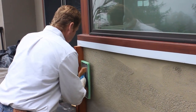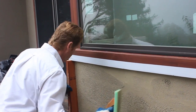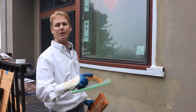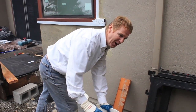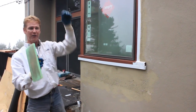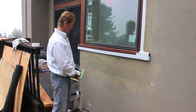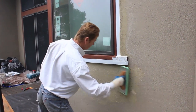And I remember when I was working Union, Danny Smith plastering, we'd be spraying out the houses, three-story houses, and we'd find a couple houses where the lathers didn't do their job. Oh, Fred would say, oh man, go grab a 20-foot or a 14-foot 2x4. Two guys, one at the top, one at the bottom, would hold the 2x4, and we'd make our corner just like that. Then when we were done with it, pull it away. So that's an old technique, guys. No magic to it. It's actually quite simple.